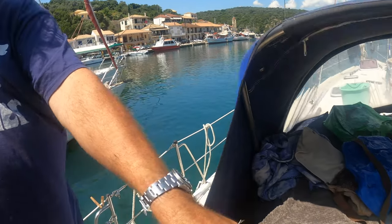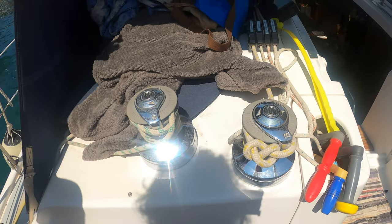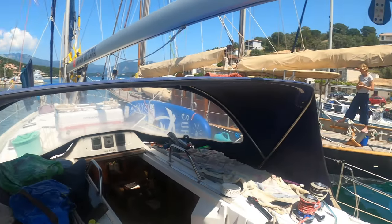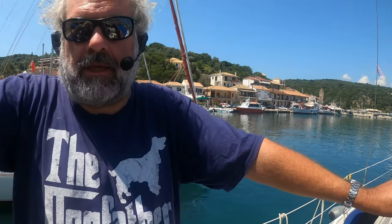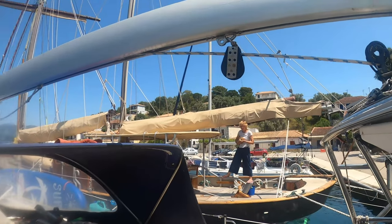Attempt number two. So, this halyard here is my safety halyard. The clutch needs to stay closed, and it needs to be - this is a safety briefing, it means pay attention. You need to keep this tight. I don't want to be able to do this and pull.